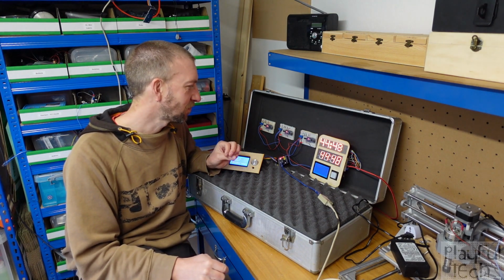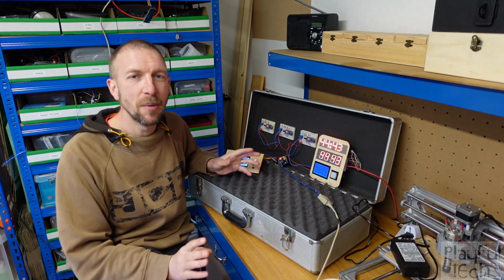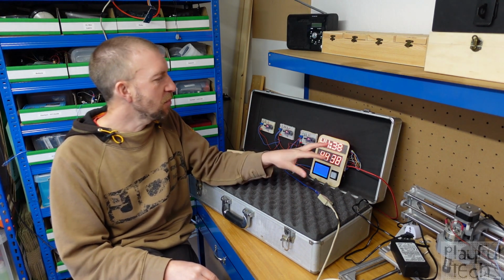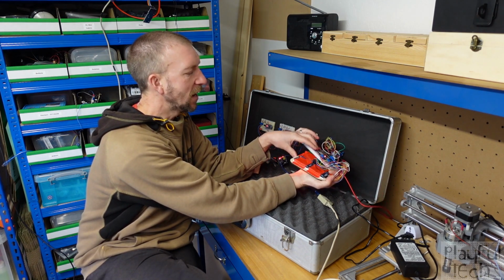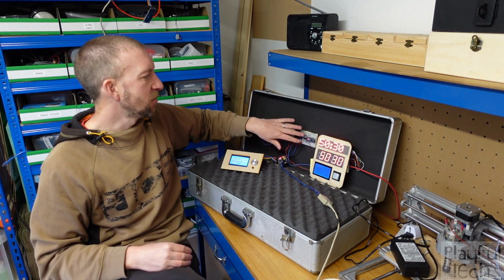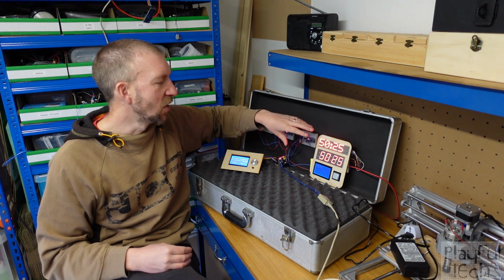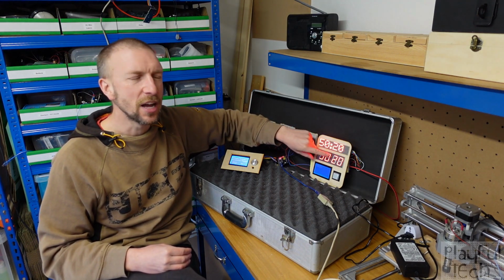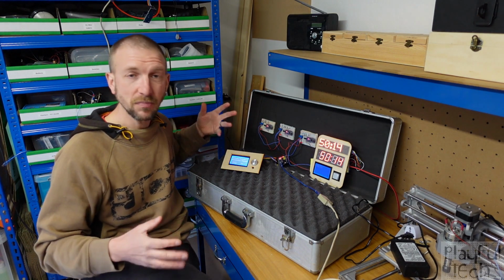So, the first comment was about the serial interface I mentioned in the last video. I had a problem that I'm using an ESP32 here to control these displays, but I'm using some Arduino boards here, and to make them interface, I'm using a serial connection between the ESP and the Arduino. And the question was, well, hang on a minute, if I can get a serial interface to work between the ESP and the Arduino here, why don't I just use a serial interface between the ESP and all the Arduino boards? That's a great question.